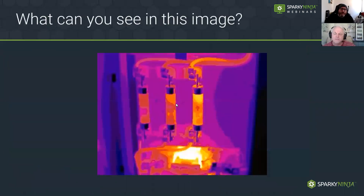Looking at these fuse caps — there's obviously some level of load on the third fuse, but you can see these caps look a lot cooler. This again is emissivity difference — the camera doesn't get as much information from those reflective caps. We don't have to try to make all emissivities match. We just need to identify the different emissivities, understand what we're seeing, and take information from the better targets — the cable insulating material, the ceramic cartridges — the higher emissivity materials.